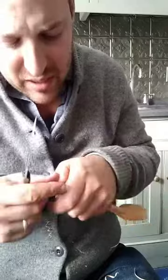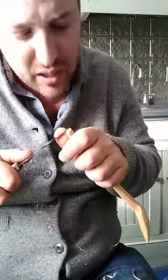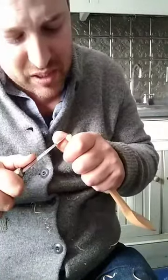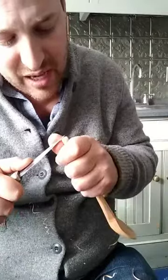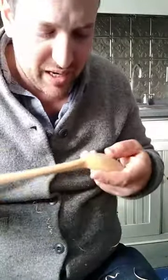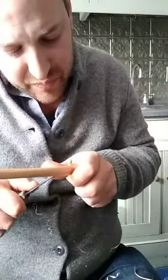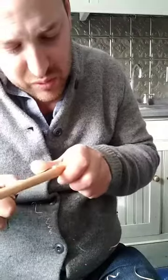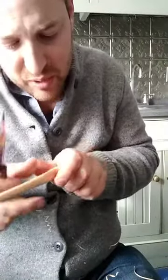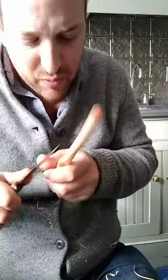Because that'll get your spoons dirty. That's one of the reasons I don't strop very often. When I do strop, no matter how careful I am to keep my strops and knives clean and to wash my hands afterwards, every time you have to sharpen or strop while you're carving, it shows up in your spoons, no matter what species they are. So I try to keep it to a minimum, and I try not to mix sharpening or stropping with carving for that reason.